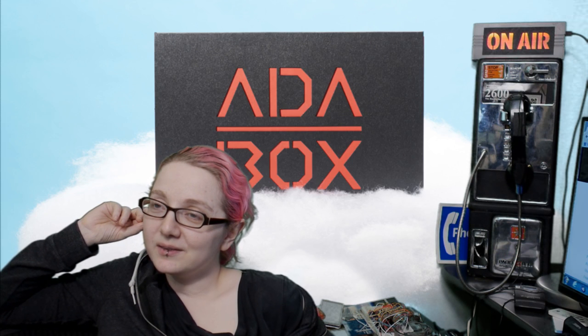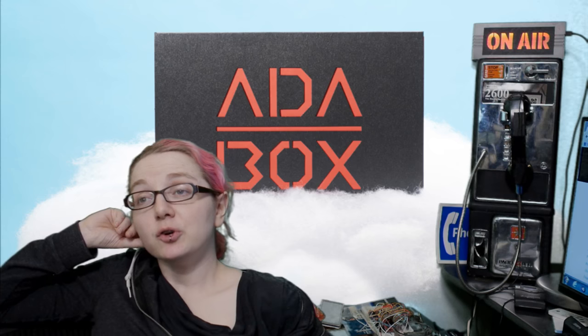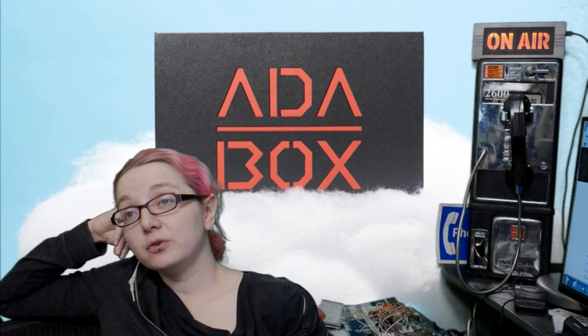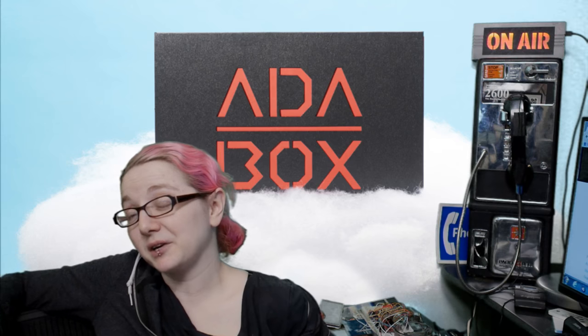Don't make us get the TXL out. Can you do a demo with the servo to turn on a computer? You could. If you want to turn on and off a computer, I would actually recommend a PowerSwitch Tail. You can just use a servo to press the button, absolutely, but a PowerSwitch Tail will actually turn the power off and on. That might be better.